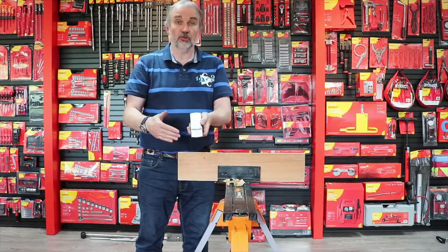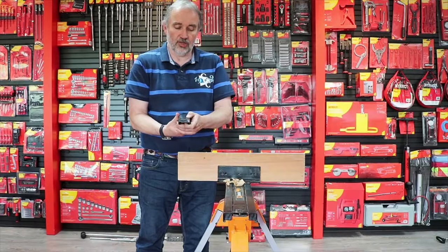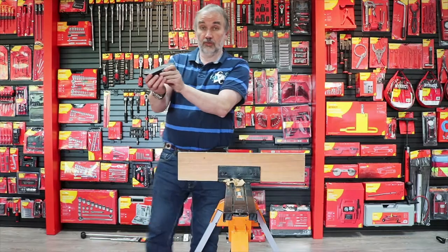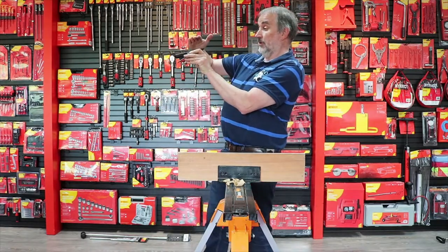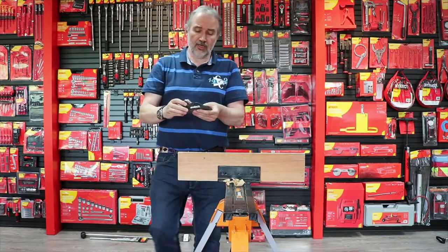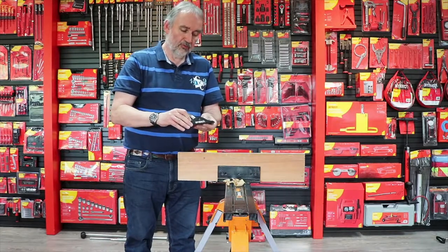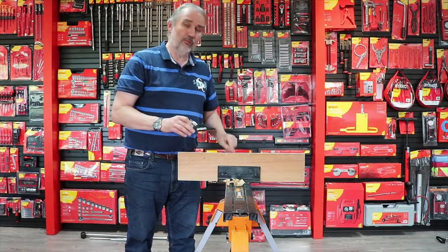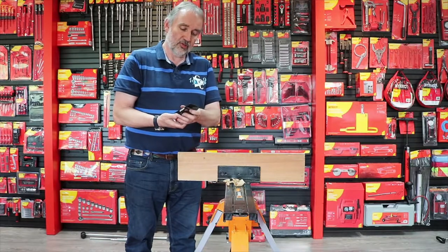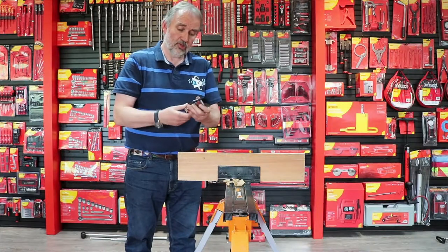When the blade is in, you can see it may be skewed at an angle, so you need to slacken off the adjuster. It has to be level — it's worth looking along the edge of the blade to make sure it is parallel with the bottom of the plane. It needs to be sticking out about half a millimetre. If too much blade is sticking out it'll jam on the wood, so adjust it — it's a little bit of trial and error. Once it's parallel, tighten the red nut down fully.